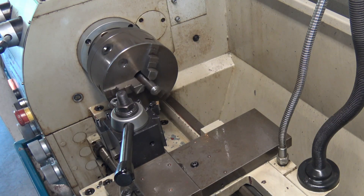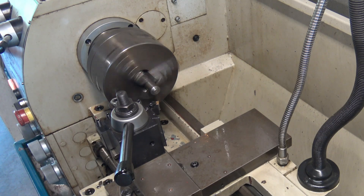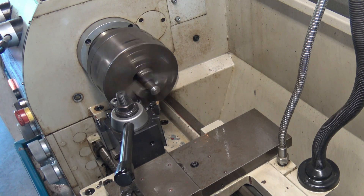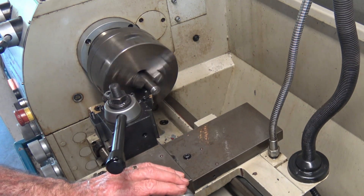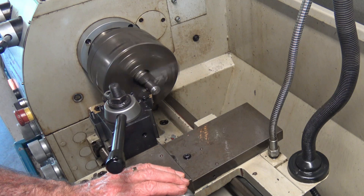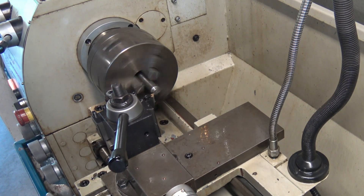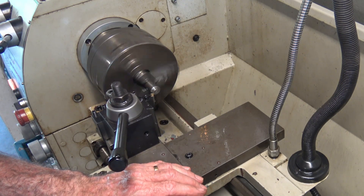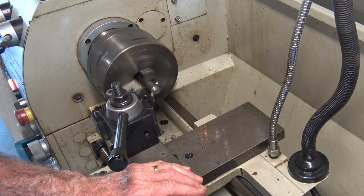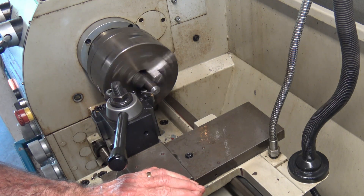I have always intended this video to show a quick and easy way to make mini screw jacks. In that vein I've chucked up a length of 20mm diameter round stock to make the turntable. Leaving the outer diameter as found at 20mm, I will be machining the end down to a cylinder 6mm in diameter and 6mm long. This cylinder will seat the turntable in the head of the bolt that I will be using as the screw.